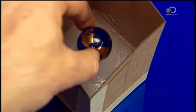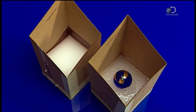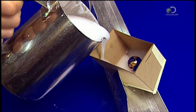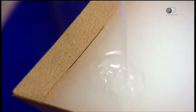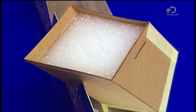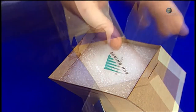Now, another two or three hour wait, until the acrylic can support a decorative object — in this case, a globe. Once they ensure it's properly centred, they pour acrylic to the next fill line and wait two to three hours again. Then they apply the client's name and logo, printed on acetate, and pour the final layer.